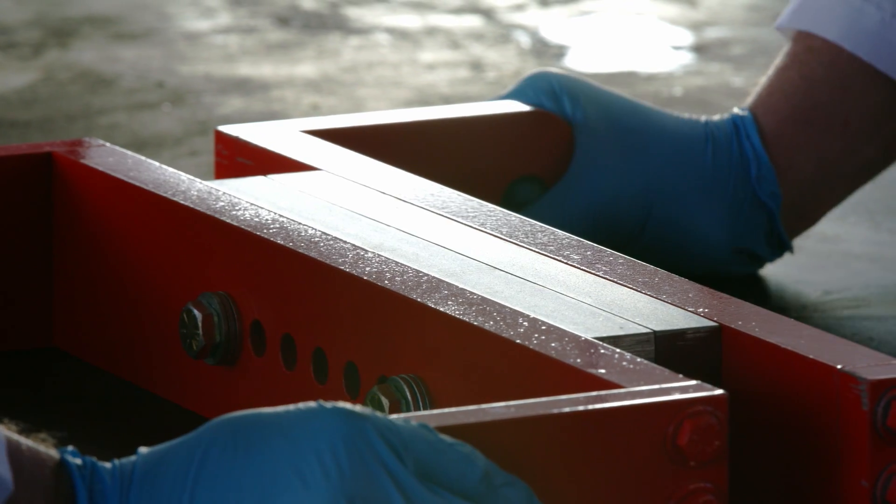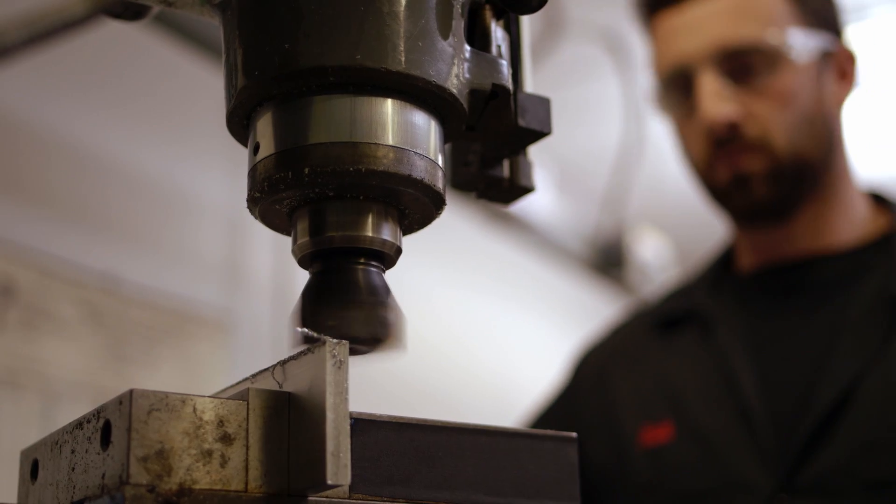Because 208 tons is a lot of weight on a 3 by 12 inch bonded assembly. We really didn't know if we could do it — we weren't sure. It's really exciting to have a problem like this; it's so big that you're not sure if you can solve it or not. We're at the mechanical limits of the pins that hold our rig onto the knuckle couplers, so we had to get chrome moly steel pins and had them heat treated so they would stand the forces being put on them.